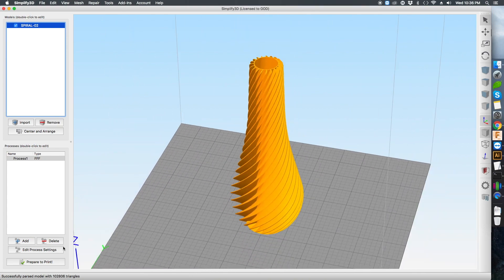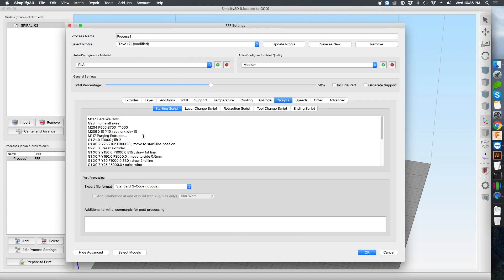Changing the PTFE tube once in a while will also help. Make sure all bolts are tightened and the X and Y axis belts are stiff. Now that the machine is ready, let's look at the software. Cura is free and helped me get into 3D printing, but Simplify3D has upped my game significantly. Yes, it is paid, but it is worth it. Both have similar customization, but Simplify3D is very easy to use, and there are various profiles shared by the community. I make sure the nozzle diameter, layer width, layer height, retraction, and temperature for the right filament are all set properly. The custom script section in Simplify3D is very useful — for example, before printing, the nozzle extrudes a thin primer line on the side of the build plate, and after the print it pushes the bed to the front for easy part removal. These subtle things add a huge advantage.